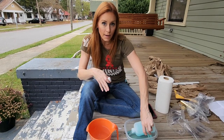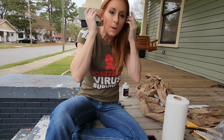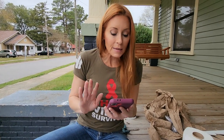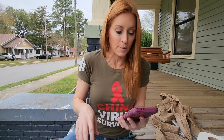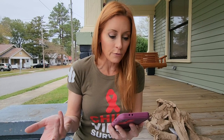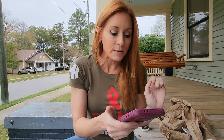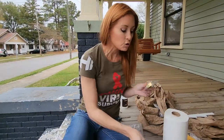It says once you're done with it you can pour it back in the bottle and it'll still be good — it might change color. It says hold it there 10 to 20 seconds, 30 seconds to a minute is probably the most you need to do. Let it soak until you've reached the color you desire, then remove the hardware and place it in water to stop the reaction. Wipe it down with a cotton rag and you'll be left with a satin sheen and a living finish that will continue to age naturally — you just gave it a head start. If you went too far, you can use a wire wheel or steel wool to clean off the patina and start again.